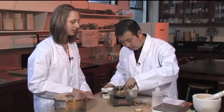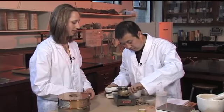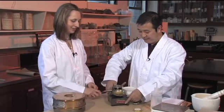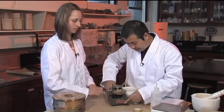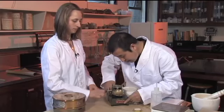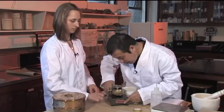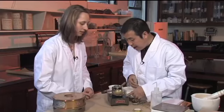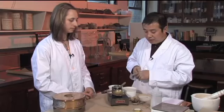We'll put in the adjusted sample and hope we have the right moisture content this time. Got our groove and we're ready to crank again. Now the groove just connects to about 13mm and the number of strokes is 32.